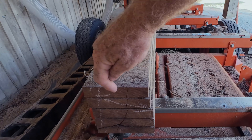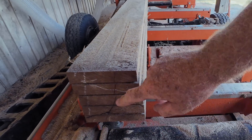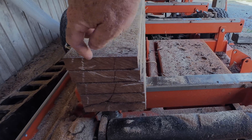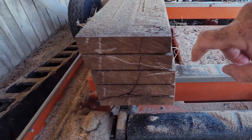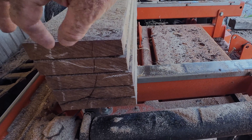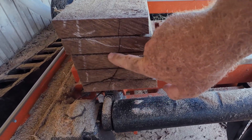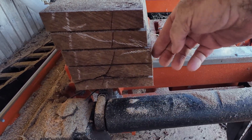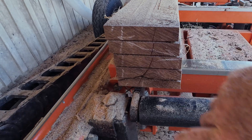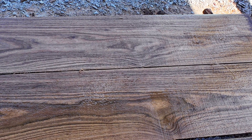Do you remember me saying stress would go that way and that way, and also up a little bit? You can see it is in fact coming up a little bit. This board's pulled that much in that direction because there's that much wood on the side of the crack — it's pulling that way. There's still a lot of imbalance pulling that way. As the board gets more balanced on that crack, the stress gets reduced, and down here it gets reduced even more. This is another reason why you always want to balance up your cant. That is some pretty looking wood.